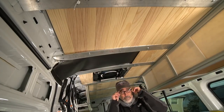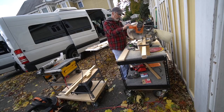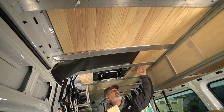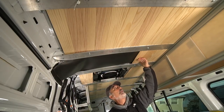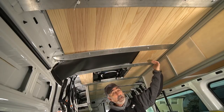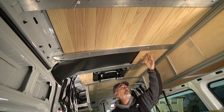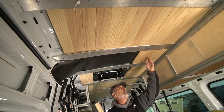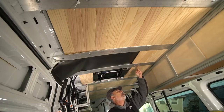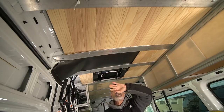My ceiling system — let's take a look at that now. Last episode, I had dry fit the boards. I cut the boards to length and dry fit them in each of these channels to see how they fit. They can't be too long or too short; we have expansion and contraction to contend with, but you've got to be able to get these boards in and out easily. The dry fit also helped me determine where to rip my boards thickness-wise so that the seams line up as it goes down the lane. That was another reason to dry fit the whole system.